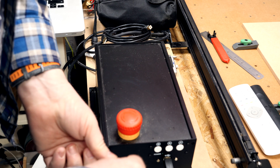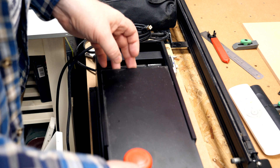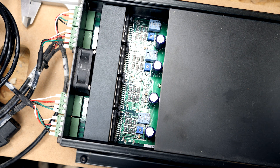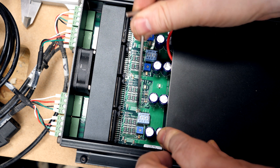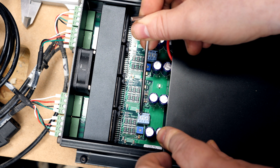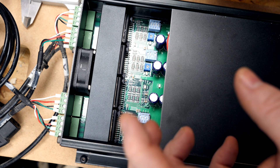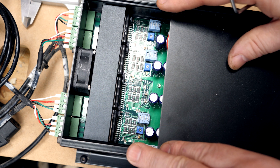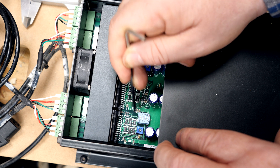We start by taking apart the X-controller — that's as much as I need to do to expose the switches at the back. You can see here the DIP switches for each of the axis controllers, and it's switch number four which is in the on position. This on position is like a power saving mode for the X-carve — effectively it means that when it's idle the motors aren't drawing any power from the controller. We'll change the switch here from on to off.